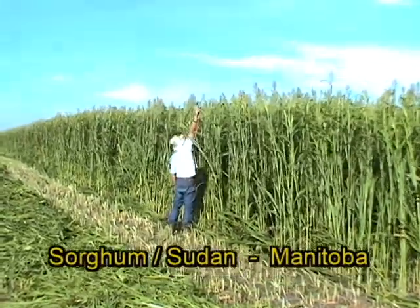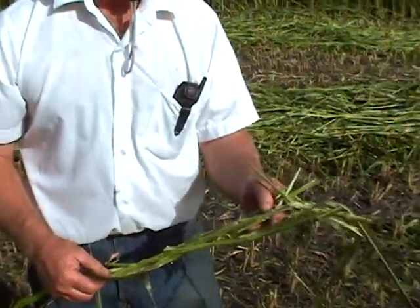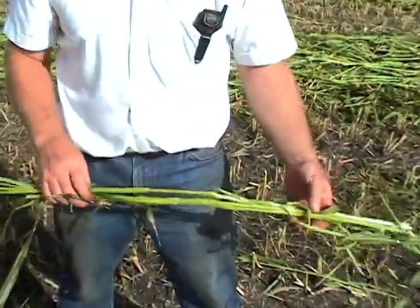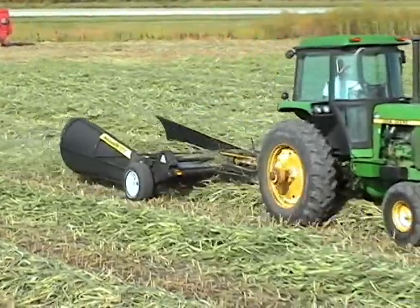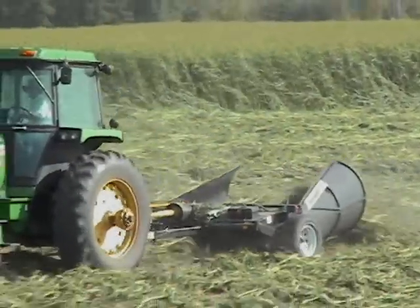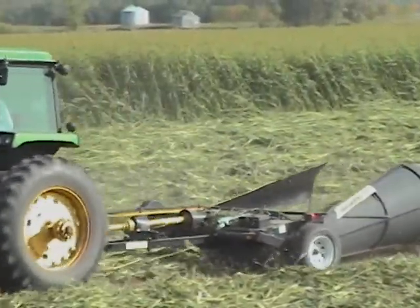With a ReCon set for heavy conditioning, the stalks come out thoroughly open, which dramatically cuts drying time to a reasonable length. This could be a great way to use these plants to your best advantage without getting hammered by the weather. The quality of the product was much better because we'd actually dried it out faster and it ended up being a softer product. Corn stover can also be dried fast. After reconning, all these products are a lot more palatable for your animals.